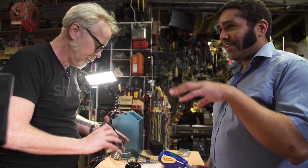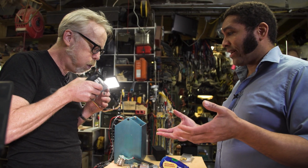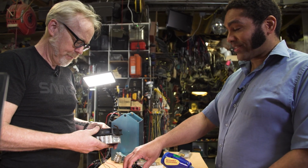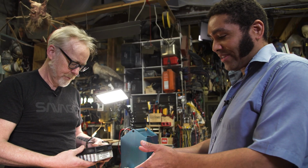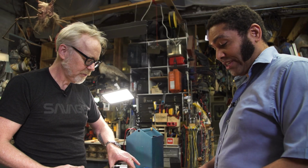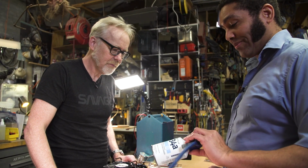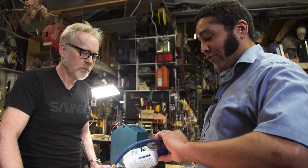It's amazing the contexts that connect something like this and how much knowledge of this context really helps put those pieces together. Like, okay, I see a compressor, I know what it does, and then I know the physics of what's happening, so I understand what goes on inside this heat exchanger and what changes when I speed the compressor up or slow it down, or change the diameter of the capillary tube, or change refrigerants from, say, R134A, which is a Freon.